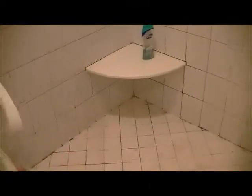If you notice, there's no fan in this shower. So there's a lot of mold and mildew issues from not enough steam escaping. When you take a shower, you only have this area right here for any moisture to get out, yet this is lower than the highest point of the shower ceiling, and so that's the reason we're going to put a fan in there eventually.